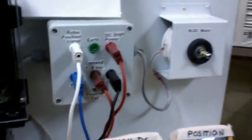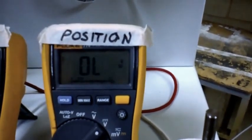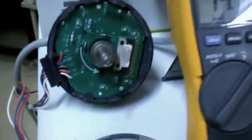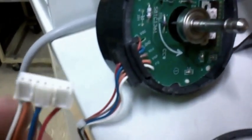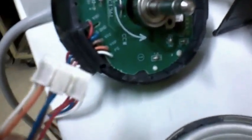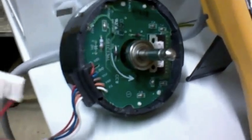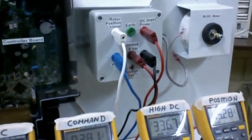If that happens, you can't always exclude the motor - the motor might actually be the issue, especially if you're not getting the rotation pulse input back. Remember that when we turn this motor around you can see that chop signal coming back - this is the sort of test you're doing to prove the motor is sending back the signal. Also if you've got harness connections - you'll see this is a cutaway of another brushless DC motor - this connection going on the circuit board, if it's subject to any corrosion or dry jointing, even in an environment where you've got minerals floating around such as coastal regions, it can create connectivity problems. You've got to look not just at the motor itself but at the actual harness. I hope that's been informative for you and I'll see you all next time.